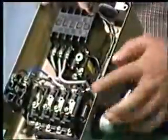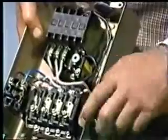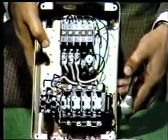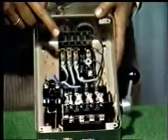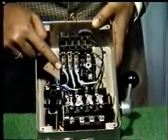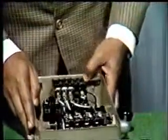Now this is the star-delta switch, which operates from off position to star position and delta position. Here is this push button and here is a contactor. And along with the contactor, we have the thermal overload relay, which is used for the protection of the motor. Now we will show the functioning of such a manual star-delta starter with the help of circuit diagrams.